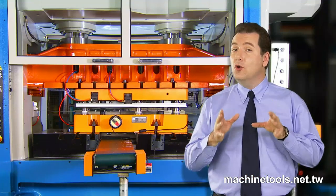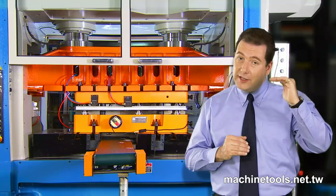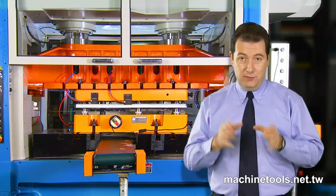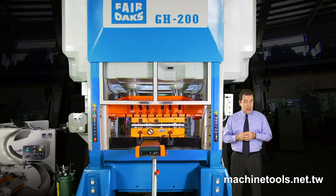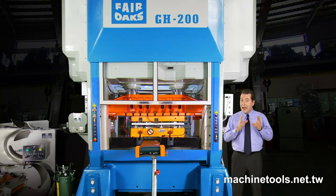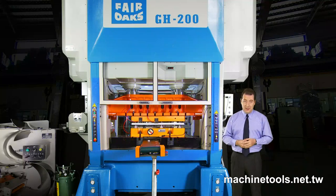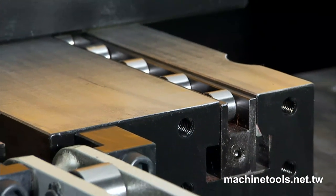The accuracy of the press operation is key, and the bolster on this press provides a repeatable positional accuracy of 0.03 millimeters on the bolster and 0.02 millimeters vertical accuracy on the press movement — quite an achievement for a press rated at up to 600 strokes per minute. Additionally, the axle on this press allows the bolster to be stopped at 135 degrees for die checking and measurement.